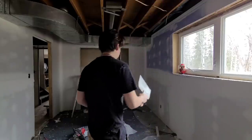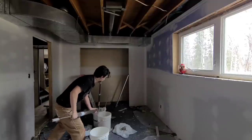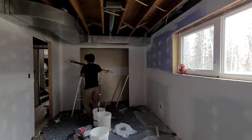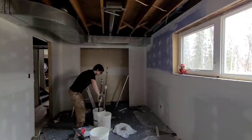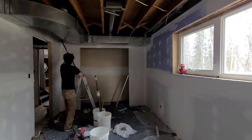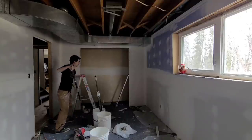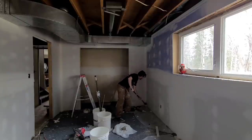So now day four, step four, we have to do our corners again, because I do them three times, and that's just so that they look good. I don't have to do any touch-ups after sanding, or very minimal anyway. So put on the mud, put on your biggest flusher. Mine is this one because my biggest one was stolen, but that's okay. Flush them out. And normally I would be doing all of them all around the entire room, not just two at a time.